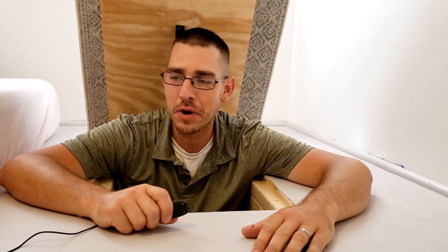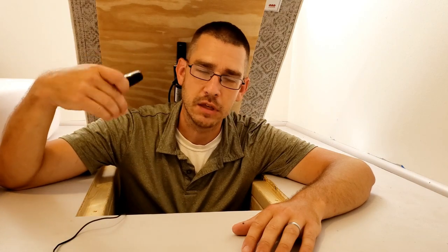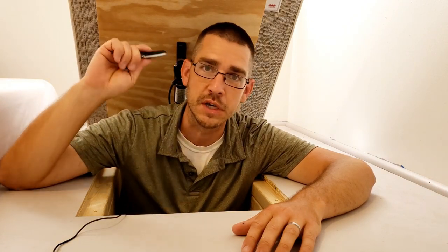This was the final piece to the platform bedroom project — the trap door is functioning, and I think she'll have a lot of fun with this. She can put bins in here, items she doesn't want her little sister to touch, and keep the remote secret. You really can't open this without the remote — the piston almost locks it without the remote. The piston does come out pretty easily though, and there is a regular handle on there, so if we ever have trouble with the piston, I can pull the pins out, the piston comes out, and it can be used as just a regular manual trap door.